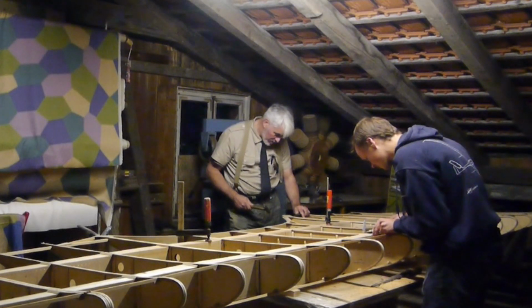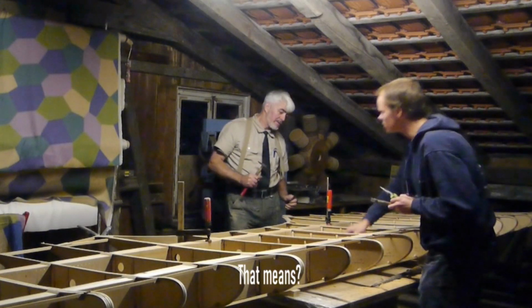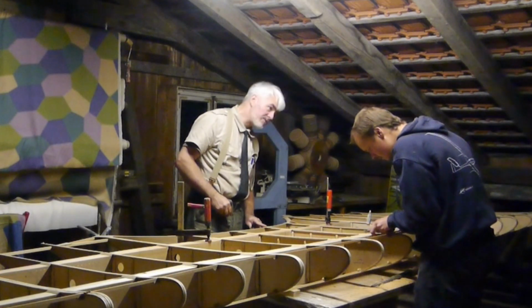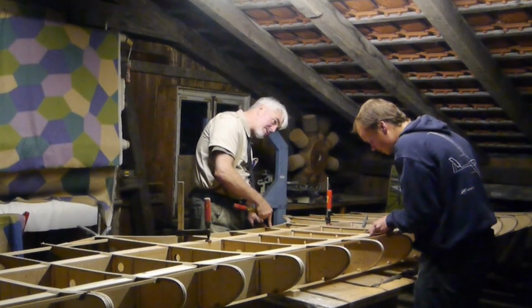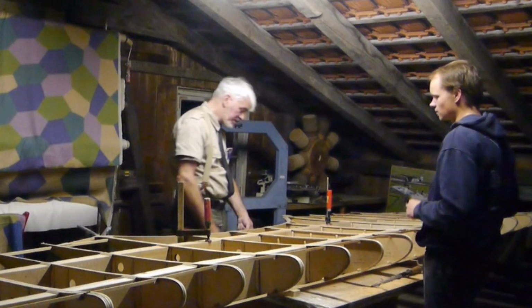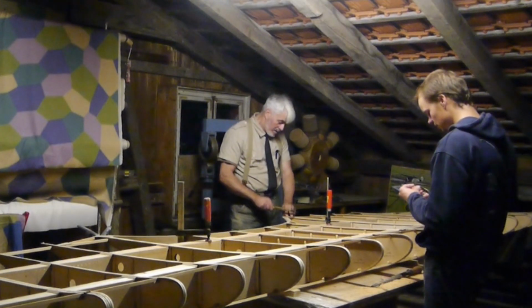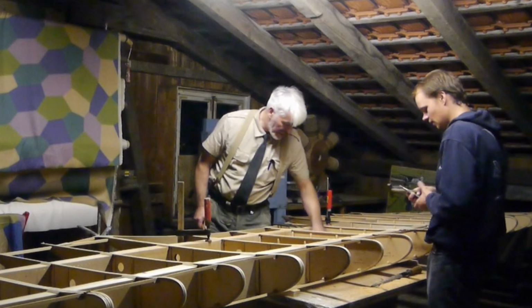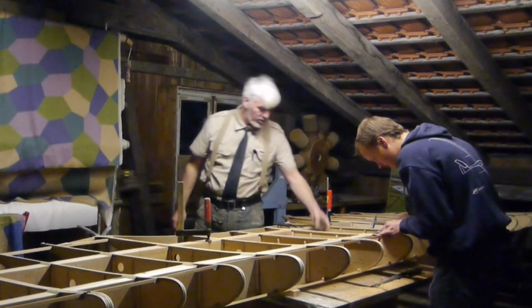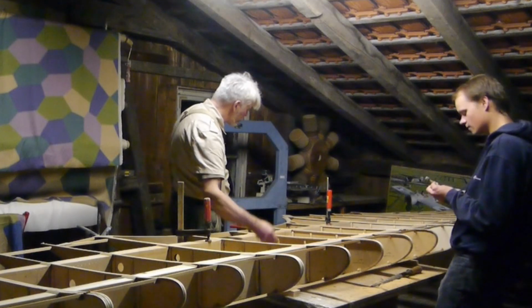In the 30s and 40s they started to use nailing strips. Nailing strips are thin wooden strips through which they nailed. And once the glue set, they used this strip to pull out the nails again, leaving small holes, of course, but they don't bother. At that time it was done that way because what they used were mainly steel or iron pins and tacks, not brass, because brass is heavier and more expensive to obtain.